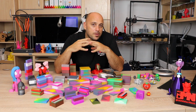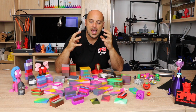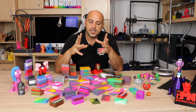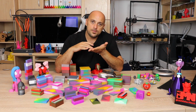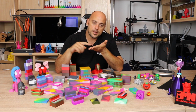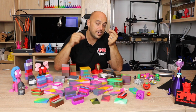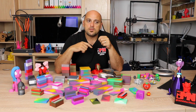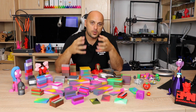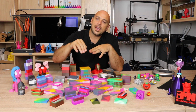Now, the Prusa i3 Mark IIS with multi-material upgrade has the ability to grab 4 filaments and push them through one nozzle thanks to a 4-way splitter. So what it does is it starts printing the model. When it needs to change the color, it moves away, starts printing a purge block, retracts one filament out of the way, pushes the other filament in, prints a certain length which is determined by the user that slices the model, and once it's done purging, it goes back to the model and continues printing.